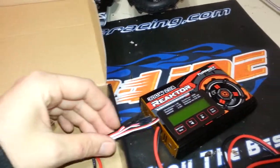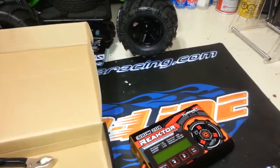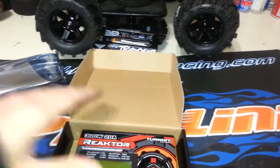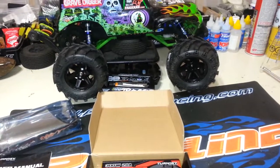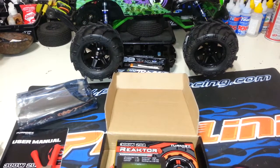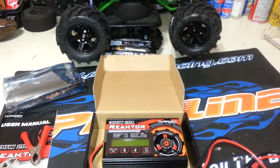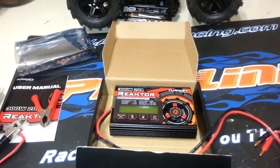Pretty good deal for 60 bucks. When I first got into the electrical side of this hobby — I've been into nitro for years — I decided to give electrics a try and now I think I have one nitro left that I haven't driven in a year. I really wish I would have gone this route rather than picking up a high-tech AC/DC charger, which is why those cost so much more. DC-only chargers are a lot cheaper, though you do need a power supply. The way to go is to pick up one of those switching power supplies on eBay.